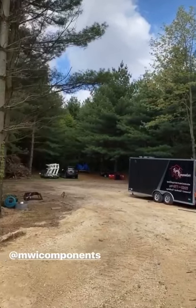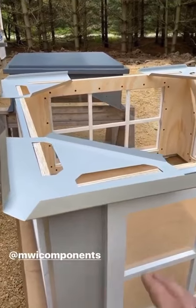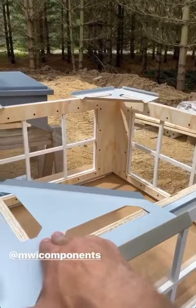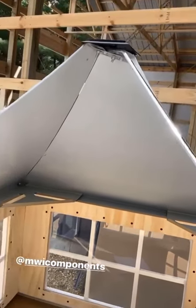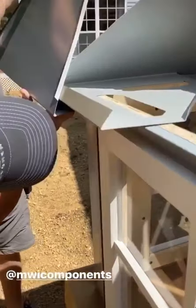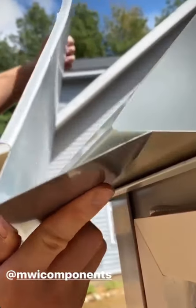It stiffens up the cupola, keeps it from getting racked side to side, and it's also going to help stiffen up the roof system. You can see how this is starting to come together — we've got that corner piece installed. You just have to kind of weave them in one at a time, and then your last one you've got to check the bottom because they do miter out nicely. There's a nice little channel that keeps it all secure — slides right in.